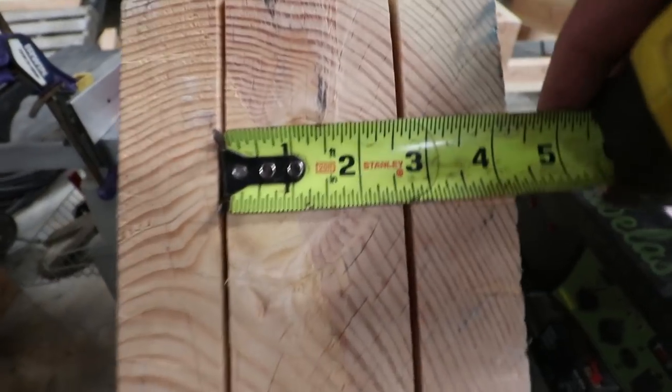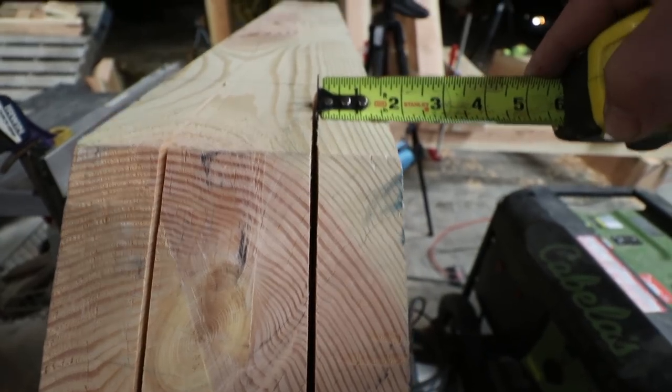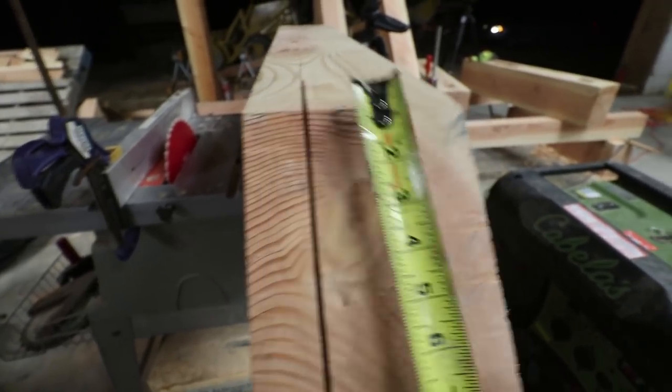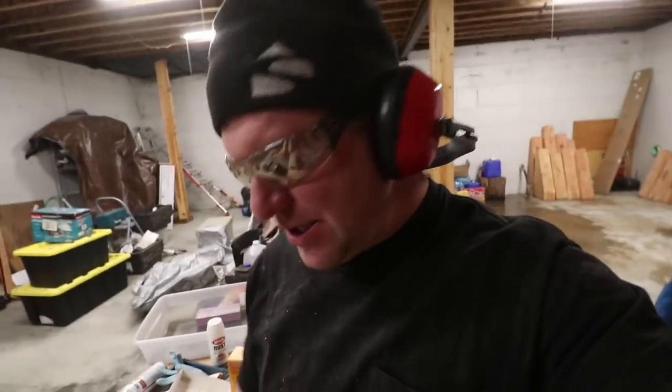This side's a little bit fat, so I can work on that and get it reduced down. This has me worried — we're at an inch and five-eighths on one side and an inch and seven-eighths on the other. Getting no love tonight. It looks like the blade is tilted, which probably goes back to that table not being flat. They showed us more advanced techniques at the workshop in Maine and let us know that the reason they don't show power tools first is that it's easy to make big mistakes really fast. This is a great example — it is faster to make these cuts, but it's really difficult to get the precision you want for these joints. It makes me hesitant to use the table saw on all these cuts, even though it's saving a huge amount of time.